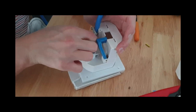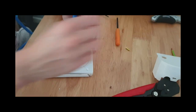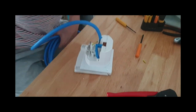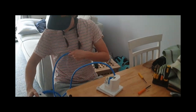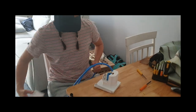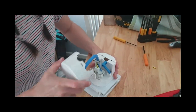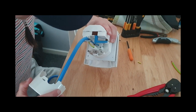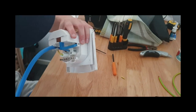So that's it all wired up - you just want to make sure they're in there nice and tight, which they are. What I should have done is threaded that onto here first, but I didn't, so I'm going to have to come from the other end. So I've got live on the left - brown on the left. Neutral on the right - blue on the right. Earth in the middle, so I have the cable in there.